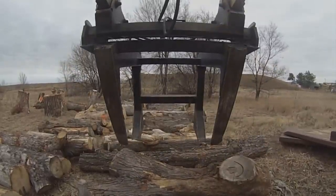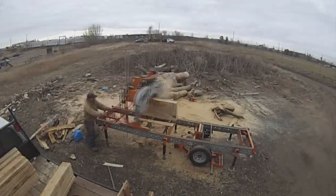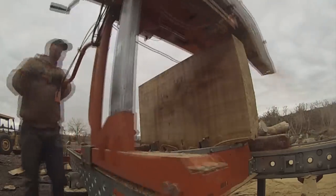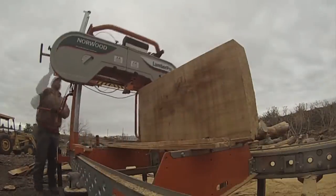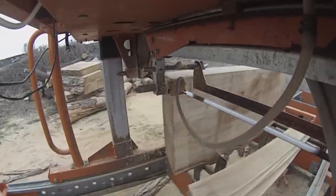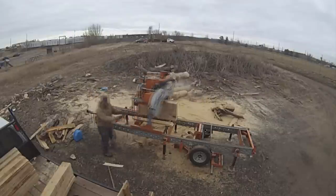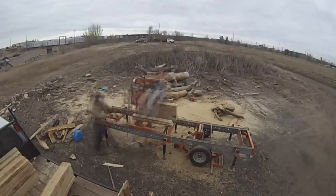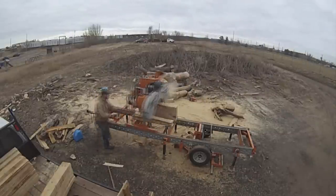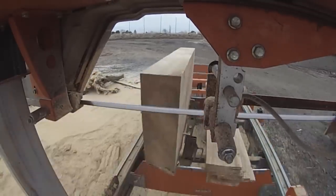To combat these issues, I use a chainsaw mill alongside my Norwood to tackle the really big logs. What you're seeing now is footage of me re-sawing 6 inch wide slabs I previously cut with the chainsaw mill from logs that started out 34 to 40 inches in diameter, and I'm using the Norwood to quickly cut 1x6 and 2x6 dimensional boards from them. I also use cobalt mixed steel blades that are capable of surviving nail hits.